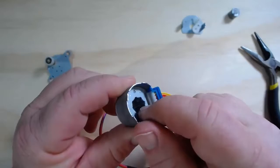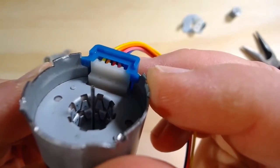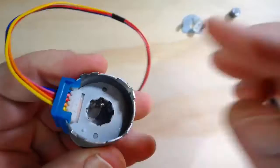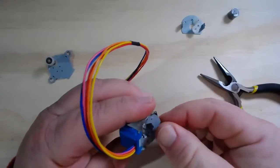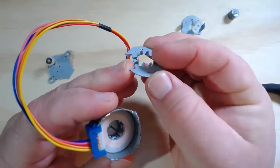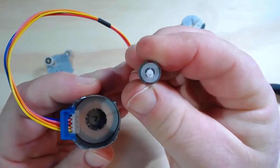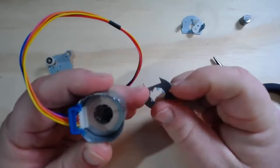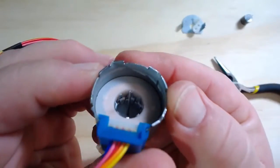Inside there is actually a set of plates with little metal teeth. Those are around the coils — the coils are hidden inside between those platters of teeth. I can start to pull those plates out — let me get in there with my pliers and work that top metal plate out. This is just a metal plate, and you'll notice it has eight little teeth pointing up off of it. It's these teeth that actually help to attract the rotor. If you look on the rotor, there are some little red marks indicating the north and south poles across its axis. As these teeth get energized magnetically, they attract the rotor.